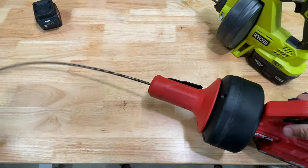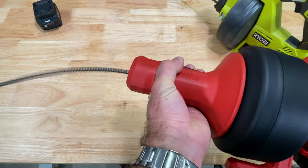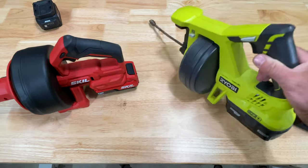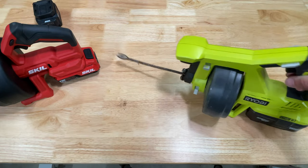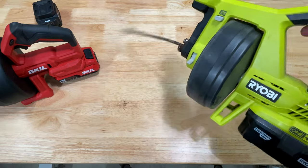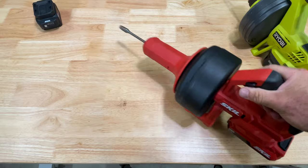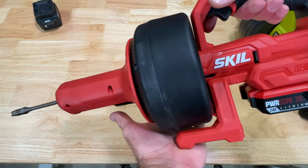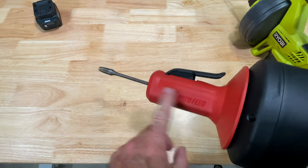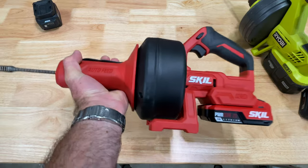This, I think, is going to be a better solution — I have not used it yet, this is clean. There is another reason I like this design better: see these little feet here? So if you're doing a tub, drain's here, you tilt this forward — you tilt the drum right into your tub and the drum hits the tub. There is nothing under the Ryobi to protect the tub from the bottom of the drum. These little feet give you something to tilt on, so as you tilt this towards a drain, that drum is not touching the bathtub or the sink. Also, the extension of this — ergonomically, this is better. Let's go clear a drain.